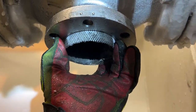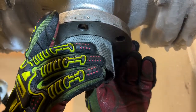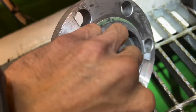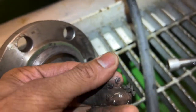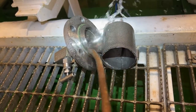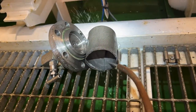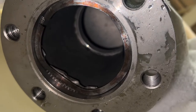Now that we're done, we open the cover flange carefully to avoid damaging the filter. Generally in the ballast passage this is the kind of garbage we find — a little bit of mud and silt from the tank, nothing serious. The filter is 10 micron so we need to be careful not to damage it. Clean it with water and compressed air, or maybe a plastic scraper — that's it. You can see the dust just washing off with water and compressed air.